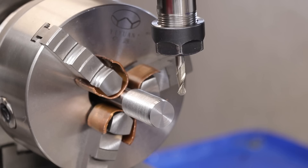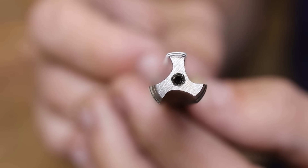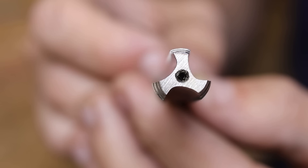Speaking of which, there are a few different ways of approaching this. A lot of books, including the Machinery's Handbook, would have you cut a flute sort of straight down the middle of the tap. I'm sure this does work, but a lot of the commercial taps that I own offset the flute sort of towards the back. This could be done for many reasons, but at least to me it looks like it produces a much sharper tap. And for that reason, that's the method I'm going to go with.